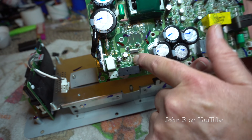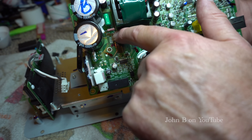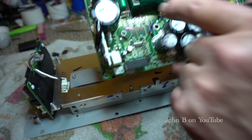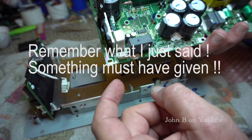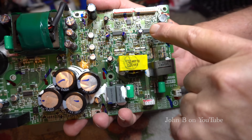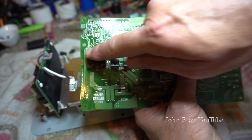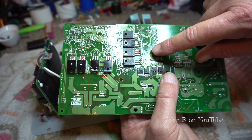None of the drivers — I'm not sure if this driver is working — but the resistors and diodes on the drive input to those FETs, none were blown up. So I'm hoping it's just those FETs. And if they're short circuit, something must have given. I'm assuming the customer has already changed this fuse. So back to the bass and treble — 500 watts apiece, class D. And there are the FETs for the bass and treble, or vice versa. And these are 15 volt regulators.